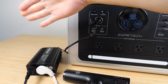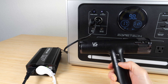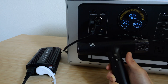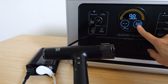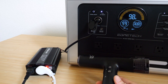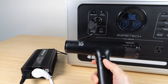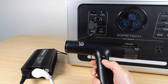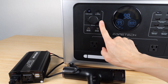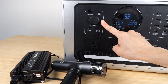I turned on the DC output and plugged in the lights I'm using right now. Adding in a fan at the lowest speed is 120 watts. The next setting pushes it over 150 watts — overcurrent — and it shows error 60 and shuts off. We can go over current for a very short time. From that we know this is 10 amp maximum. It's a resettable fuse — just make sure you don't go over wattage afterwards and it will turn back on.